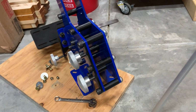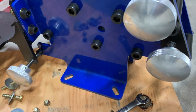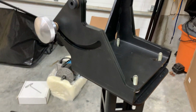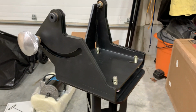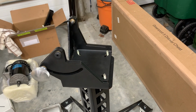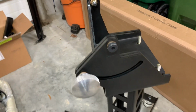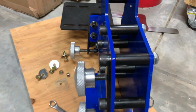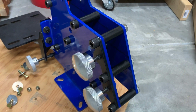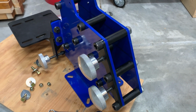And this is kind of important because the foot can be placed in 90 degrees as you like it, in accordance to this pedestal. So in 90-degree increments, you can just rotate it around the clock and you'll end up installing it wrong if you're not paying attention. What you want is you want this knurled knob here to be perpendicular to these two knurled knobs for your tooling arms. Otherwise, you end up with some weird amalgamation of assembly that's just not going to work for you.